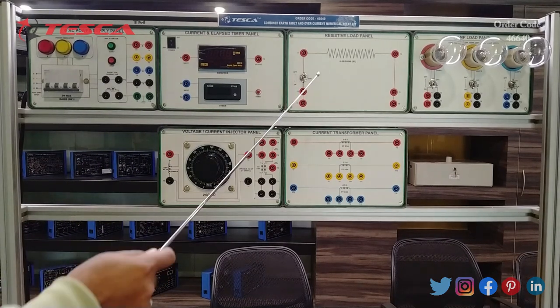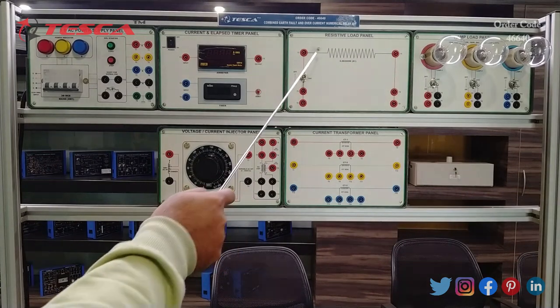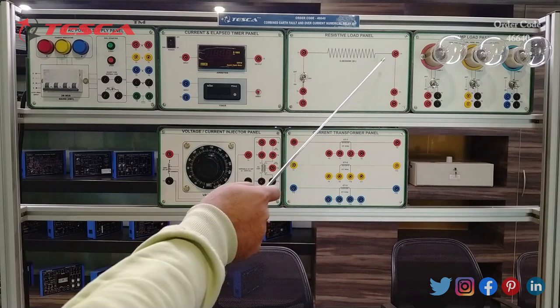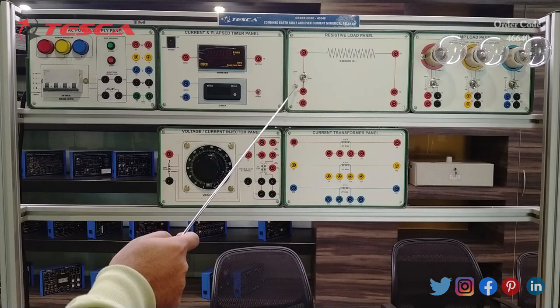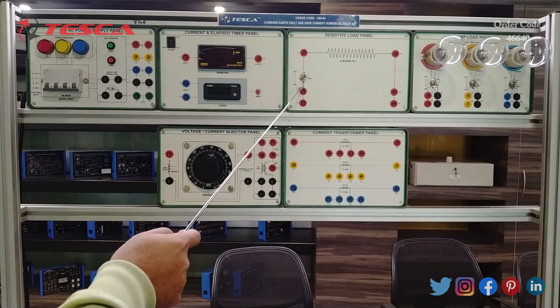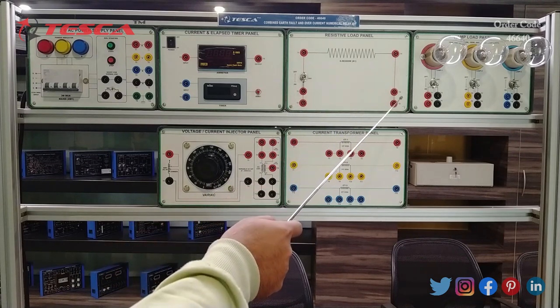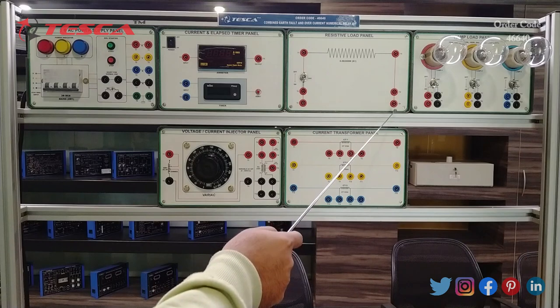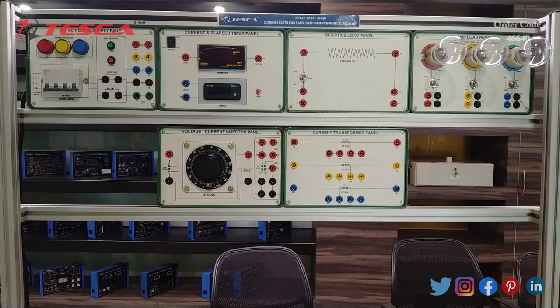At the third panel we have a resistive load of 0.5 ohm at 200 watts. This resistive load is connected at T1 and T4. T1 is further connected with a toggle switch of sufficient rating for providing up to 5 amperes of current. T3 and T2 are internally connected for expansion connections and the other terminals T5 and T6 are for connecting resistive loads to other components and panels.